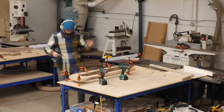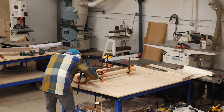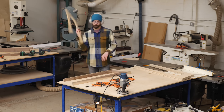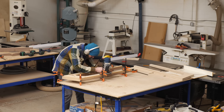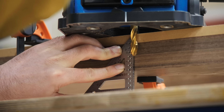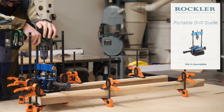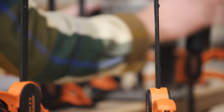Here's a real-time clip of me completing one of the 6 slats, only sped up — this clip is 28 minutes long, so basically it was a solid 3 hours of doing the same thing over and over. The only slight change of pace was that for the outside slats, the initial holes couldn't go all the way through, so I set a depth on my portable drill guide and proceeded that way. Technically I could have done this for all the slats, but then I'd need to insert the dowel from both sides rather than just one.